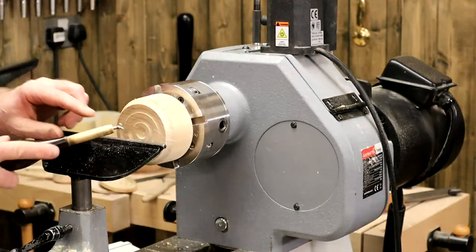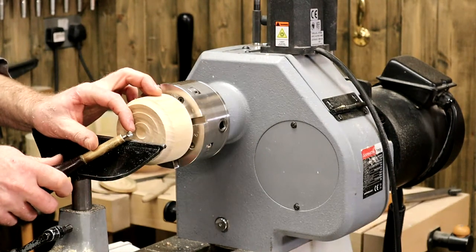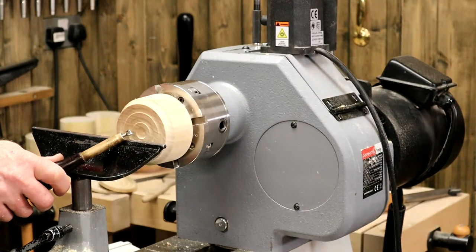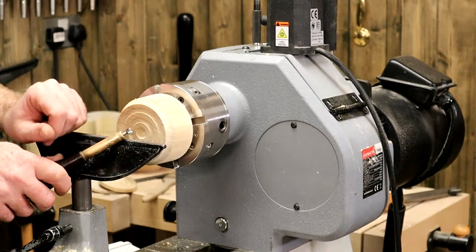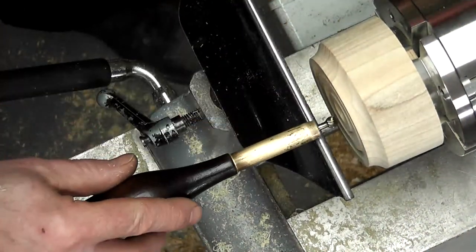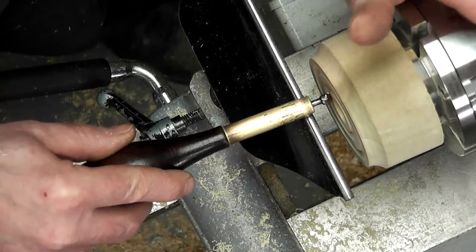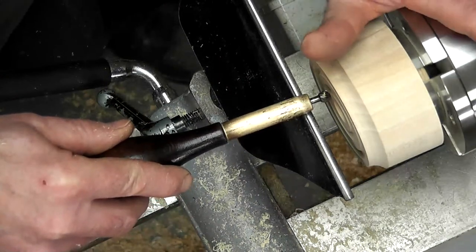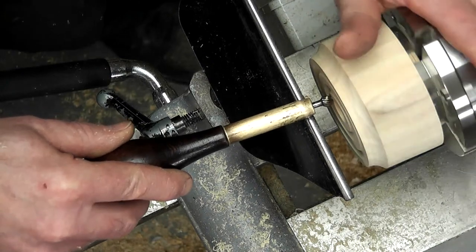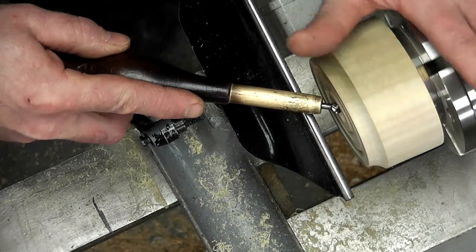Now with the cutter, we've got the ball one. I want to be using, if I look at the ball like I am now, it's probably about 10 o'clock on the ball. So if you can imagine taking that as a complete ball as you look at it visually, holding it in hand, we've got 12 would be the very center. Coming back, I want to cut just off center with it. If I push it in central and dead square, the ball's not going to go round. Especially if I come to there, you're just going to drag and make a line. That cutter's got to rotate for it to do the effect we want. So that does that. You're not going to make anything of the pattern. We've got to present it slightly off center so the cutter rotates.